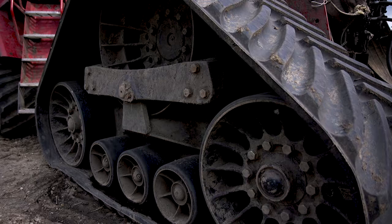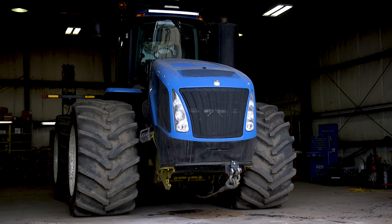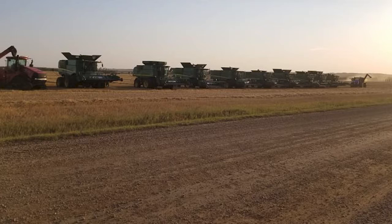Some of our land, as you get in larger lands further away, you need a little faster tractor to get there. The difference for us was 17 miles an hour with the tracks. Now we're 25 miles an hour with these tires. The LSW tire was way smoother. Now you can go 25 miles an hour and get to the field way faster, which is better because it's on the grain cart. Combines are already full and the tractor's just arriving when the other tractors are already there. On a 20-mile drive going to a different field, you're gaining a half hour difference. You figure that out — say you do 30, 32 acres an hour — you're in the field a half hour sooner on that drive with these LSWs.